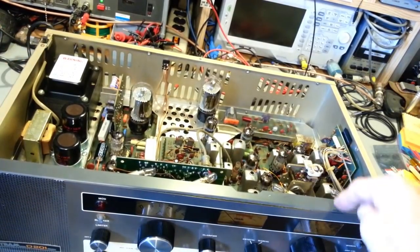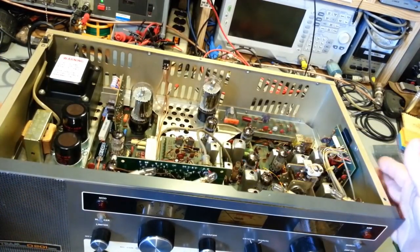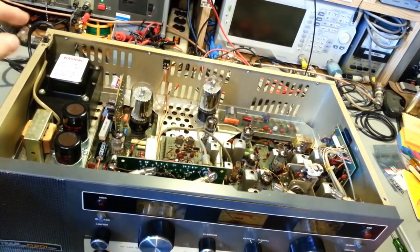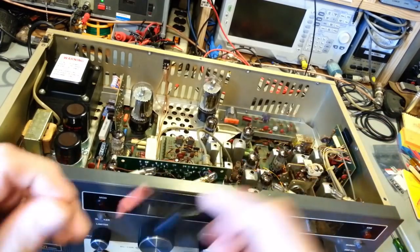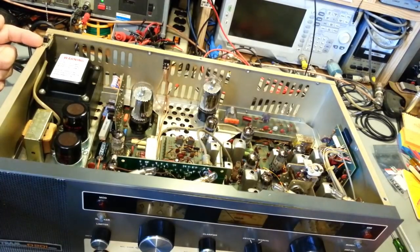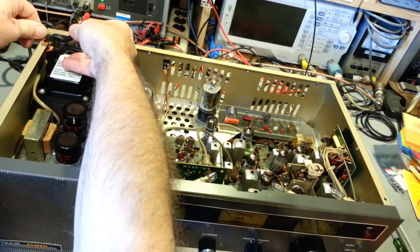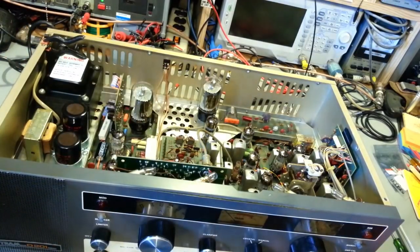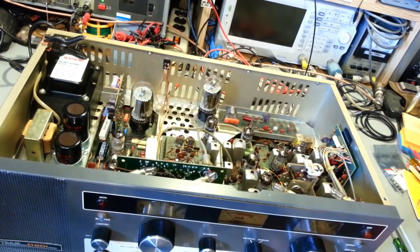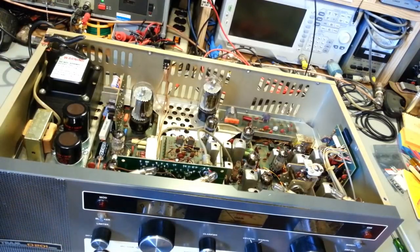So in those radios, if you're working on the radio and you want it turned on with the top cover off, you need to make sure you have a screw in there. With these, I just use these little plastic clips here. Flip around there, little guy. Little plastic clamps, because the spacing's just about perfect between that screw head and the lever there that it holds it back and works. And it's all plastic, so you got to remember, there is high voltage there, line voltage there. So I don't have to worry about getting electrocuted because it's plastic.